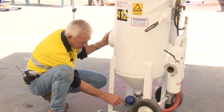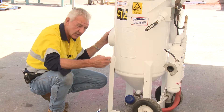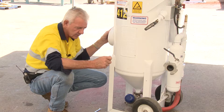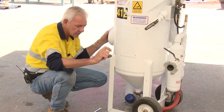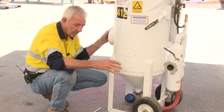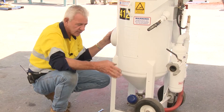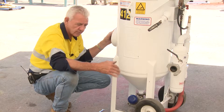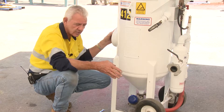Remember appropriating the grit as far as dispensation is concerned — where it exits the nozzle. If you hold the nozzle up with the dead man depressed, you'll be able to watch the mantle in the end of the blast nozzle. The mix of air and grit gives a definitive blue color when you hold the nozzle up to the light — once you see that, you know you're on track. If you've got too much grit, the noise from the nozzle is dull. If you don't have enough grit, the noise from the nozzle is quite sharp.